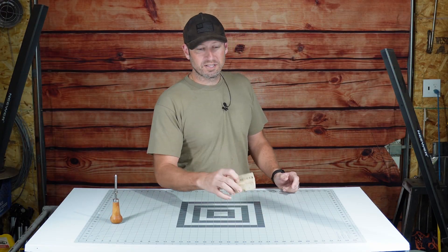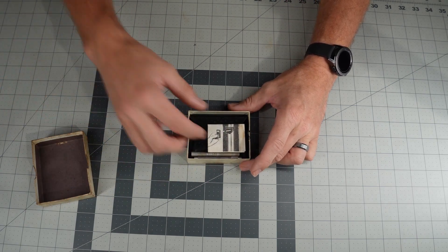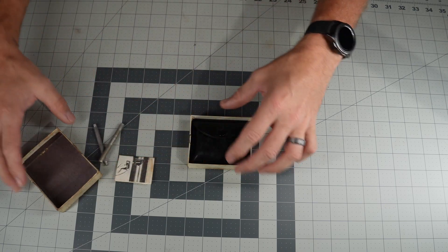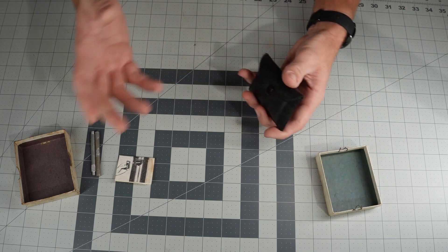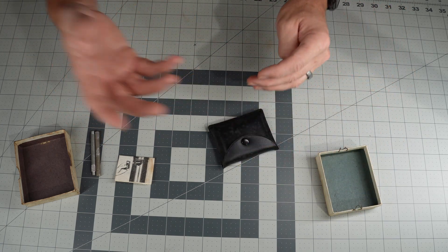Let's get a closer view at the manometer. As I'm unboxing this, let's first cover what a manometer is. A manometer measures inches of water column. Water column is how we measure pressure in a lot of gas type systems or flue systems — flue meaning exhaust gases.